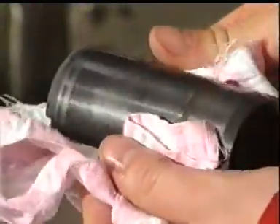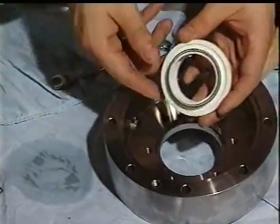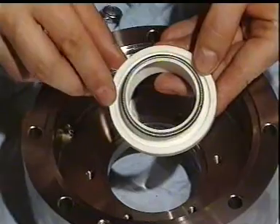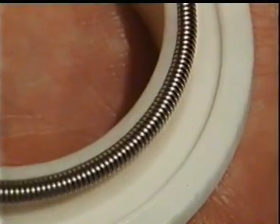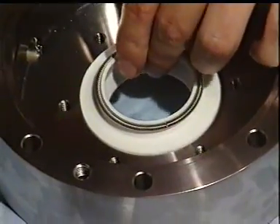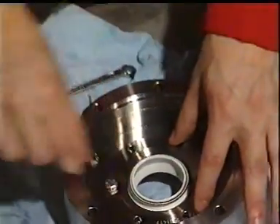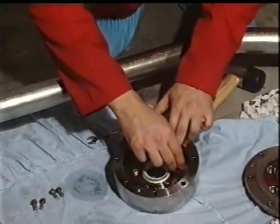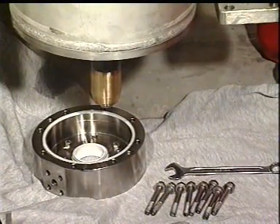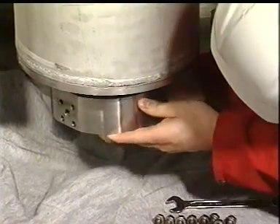The ceramic sleeve is equal at either end. To increase lifetime, the sleeve can be turned 180 degrees. The double cargo lip seal must also be installed correctly. On this cargo pump, the two springs on the double cargo lip seal are equal — no spring with red marking — but the groove on the seal must be facing down towards the pump impeller. Check all seal elements, seal grooves, and seal faces carefully. Pay special attention to the Teflon rings and be absolutely sure of no deformation.